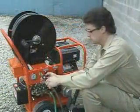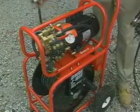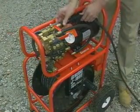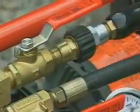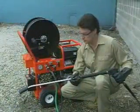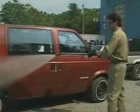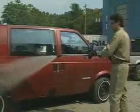To operate the spray wand, connect the high-pressure hose and trigger to the accessory outlet. On smaller jets, disconnect the jet hose and attach the spray wand. Rotate the ball valve to the accessory position, or for electric jets, open the output valve. Turn on the water supply, then squeeze the trigger to purge air from the system. Continue to squeeze the trigger as you start the machine. As with any jet usage, you must wear goggles, rubber gloves, and boots while operating the spray wand.